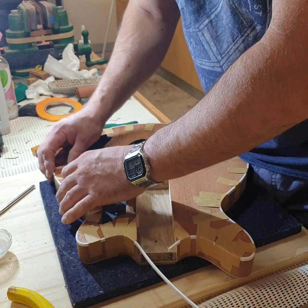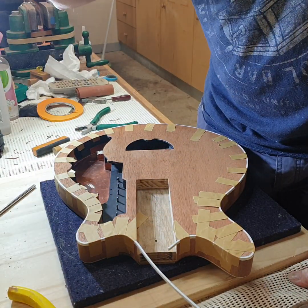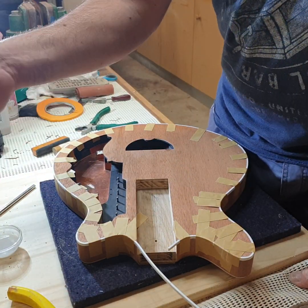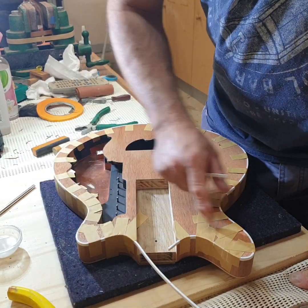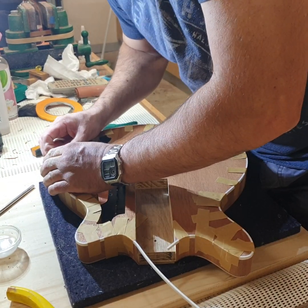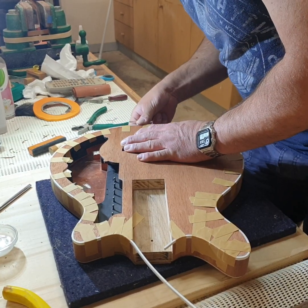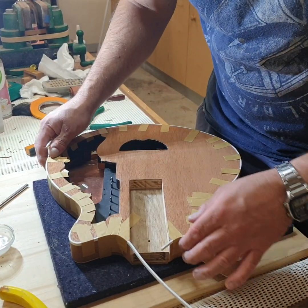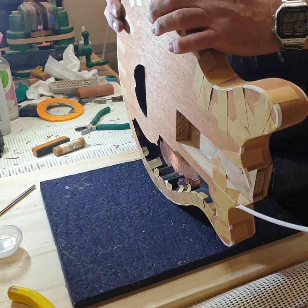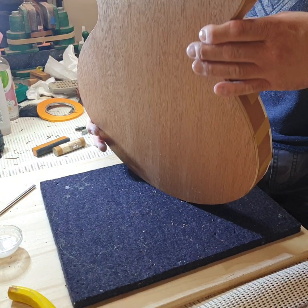If there are any small gaps, you just mix the acetone and offcuts of the binding, and it turns into a paste. You get the paste, put it in any little gap you might have, wait for it to dry, and you can sand it back, scrape it back. And once it's all sanded and painted and all that, it just looks like one solid piece of binding. That's come up pretty good, if I must say.